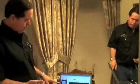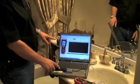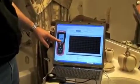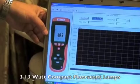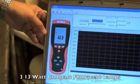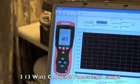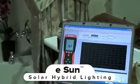If you look down at the screen, we have a certified calibrated test meter which is indicating how many foot candles of light. In this particular application we have about 40 to 41 foot candles — that's with three 13-watt compact fluorescent lamps. As you can see on the monitor, there's approximately 40 to 41 foot candles.